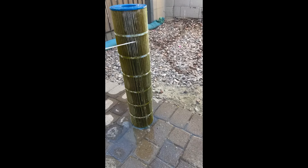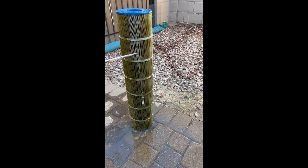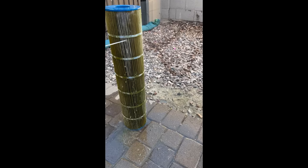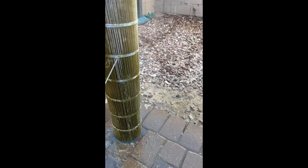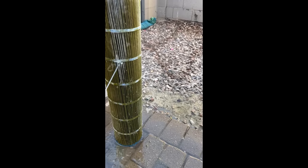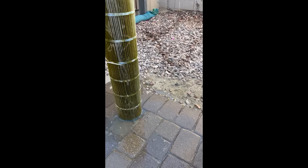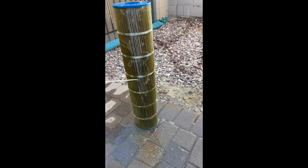It takes a long time — maybe 20 to 30 minutes — but if you want it done right you're going to have to take that much time to really get it done correctly. Another tip: use the wand to get underneath these bands from below and get some more debris out. See how more debris comes out there? So if you go upwards, get the debris out and then go from the top down, everything rinses out pretty well. I won't keep this video going for 20 to 30 more minutes but I'll show you where we are with the next steps in the process.